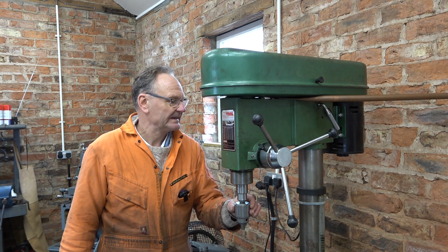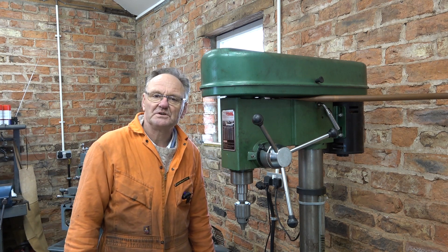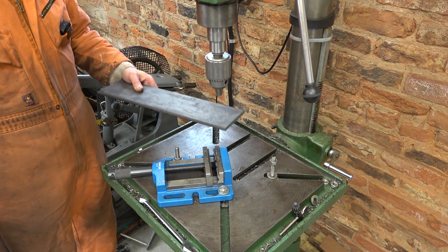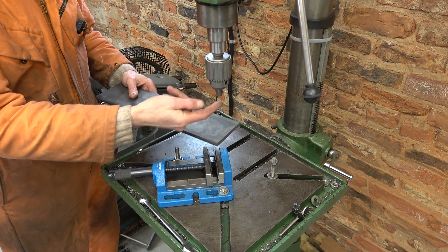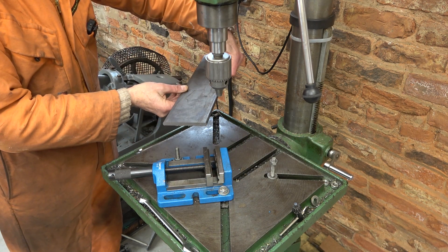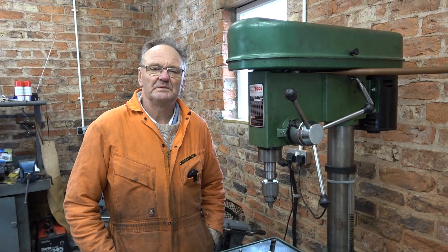One job became five, but the whole thing's a lot quieter now. We don't have the problem with the unreliable switch anymore. We get a bit of noise between the spline and the pulley, but that's unavoidable. And the whole thing's a lot more rigid now with these two braces on. So I can do the job that I need to do, which I'll tell you about now. In an upcoming project, I need to machine a semi-circle on the end of this black plate. What I'm planning to do is put it on a rotary table on this platform with an end mill, jiggle this around to get it in the right place, and then hopefully take the excess off with a hacksaw but do the finishing with the end mill. Well, I hope this has been useful to you. Thanks for watching.